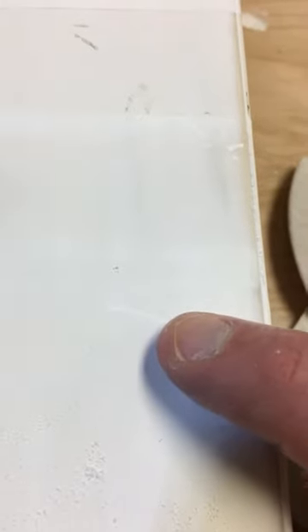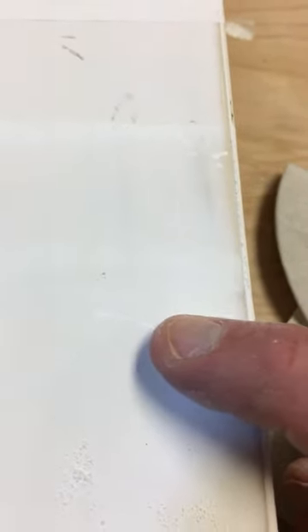By the way, this is 180 that I used off the orbital sander — it's not even the correct sandpaper. I think the grit the can said was 320. But look at what this primer does. If you see this white line right here, that was a hole — there's a little nick in the wood. Those were nicks in the wood; they're filled in by the powder.